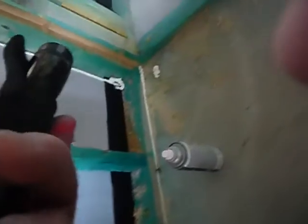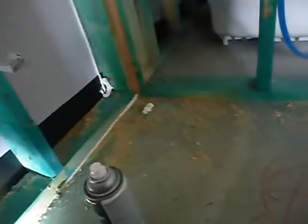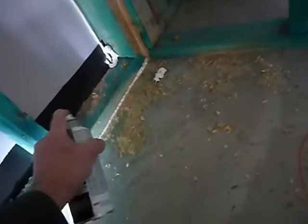You know what I'm not seeing? Look at that. I can't see around corners. I'm seeing nails, nails, nails, nails. What are you supposed to have within 12 inches of the end? You're supposed to have one of those anchor bolts. And since I can't see any anchor bolts out there, if it were me, I'd put it right there. Or you could put one right here and then put one over there. Can somebody get in there and do an anchor bolt? Let's try. You'd be glad you did.